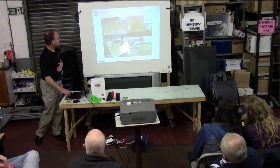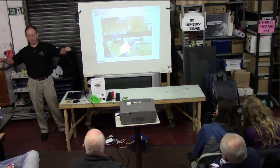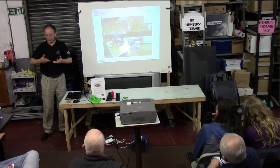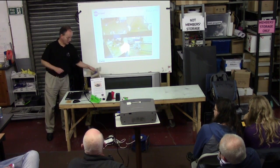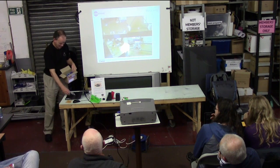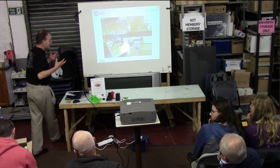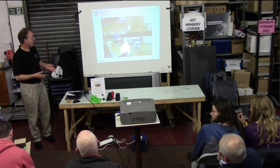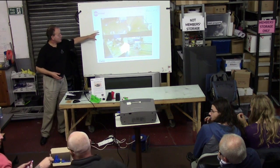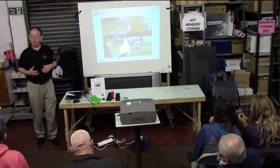So here's how we go. You start out with a whole load of threaded steel bars and lots of M8 steel nuts and bolts. Someone gives you a box like this — do pass that round — those are all the plastic bits. About 60% of the RepRap is printed on another RepRap. You then use the steel bars, which form the frame, to hold these plastic pieces together.